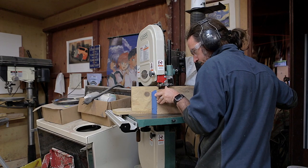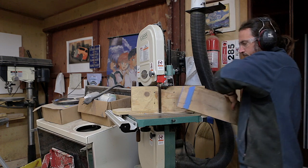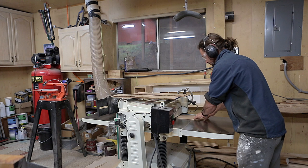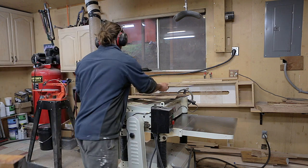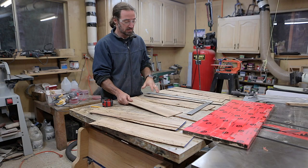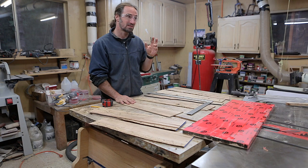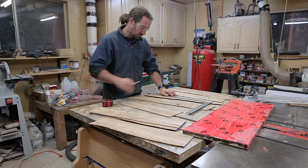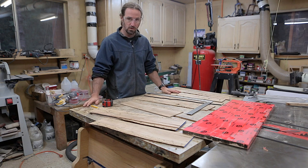After I re-saw a piece, I'll re-plane the main big thick block again to get the side parallel before doing the next piece. I've planed these all down — they should have been about 250 thousandths or a quarter inch thick, but I suck at re-sawing and they ended up to be about 200 thousandths. A little bit under but that should be okay. Next time I'm going to re-saw a little bit wider because I just can't keep it going straight on my band saw. Now I need to cut them down to size and then I can set up my mold and add some epoxy.